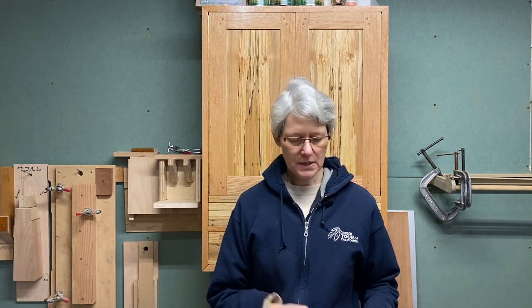I felt the perfect solution was an end grain cutting board. You need the end grain, you need little pieces. The problem is trying to get everything flat and uniform. So the first thing I had to do was take my trusty plane and plane everything down to about the same thickness, because it's so short you can't really run it through an electric planer. So of course I'm gonna be using my hand plane on that.